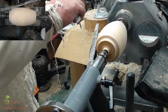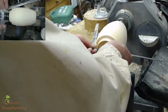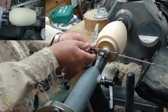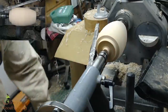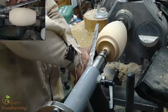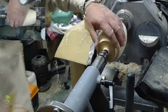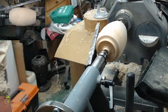My jaws, around about 46 mil. And then left hand point, straight, right hand point, eyes it in. That's where my spigot's gonna be. My hands are in the way, obviously, but there to there. So now, the famous dreaded skew. We've just cut our spigot. Now I want this about 12 mil deep. 11 mil deep, and I've got 12 mil there, so that's me spigot depth. Just double checking that, that's right. Yeah, I've got 15, so that'll be about right.